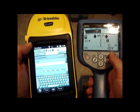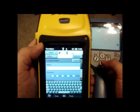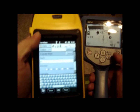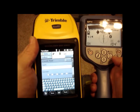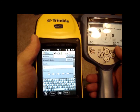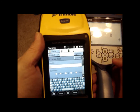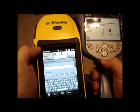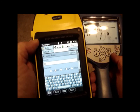Once you've located the line and have a depth reading showing up in the bottom right-hand corner, you can send that depth reading over to the GPS and have it import into the attribute named Depth — the same attribute name we set up in the setup screen. I push the survey cert button; you can see one foot four inches showing up on screen. I'm sending it over via Bluetooth, and there it shows up right underneath the word depth — it's coming up as 16 inches, because it converts straight to inches. As I get deeper — there's one foot six — I'll send that over, and it changes to 18 inches.